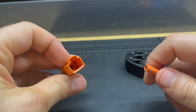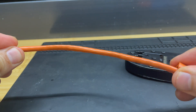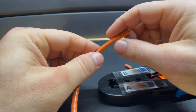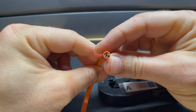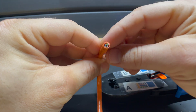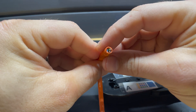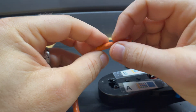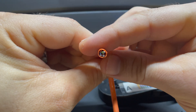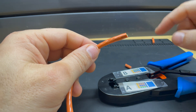The next part is completely optional, but if you want to use a strain relief boot, go ahead and slide that on and pull it out of the way. The next step is to strip the outer jacket. Depending on the type of cable you're working with, you may want to strip a little bit and then use a rip cord to strip the outer jacket — that's probably the best, most reliable way. But if you don't have a rip cord in your cable, you're going to have to be very careful not to nick any of the inner wires.